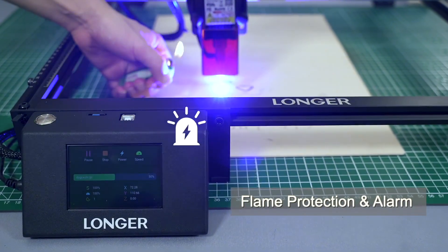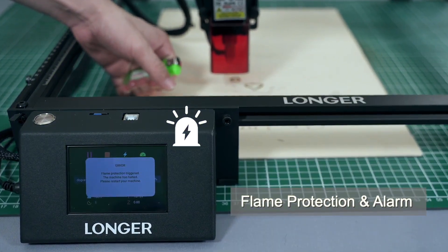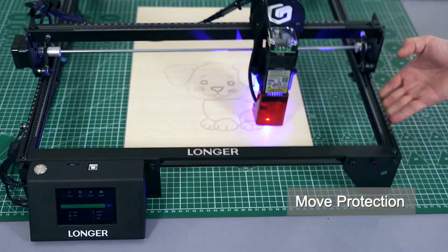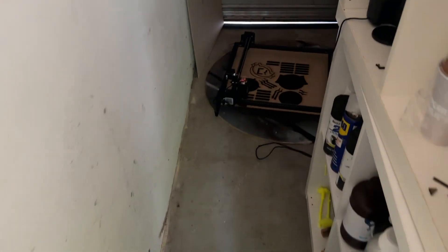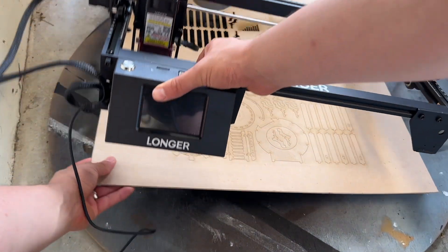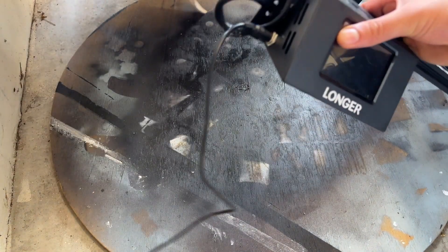In terms of safety, it's got a bunch of safety features: flame detection, collision detection, and movement detection. So if you move the engraver while it's operating, all those things trigger it to stop and cease operation. Just a side note though — if anything like that happens, the beeping is really annoying. For me, I was in the garage near it so I could hear it, and I think it's probably designed that way so if you're not in the same room, you know something's wrong.